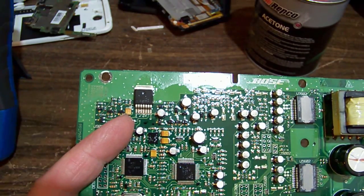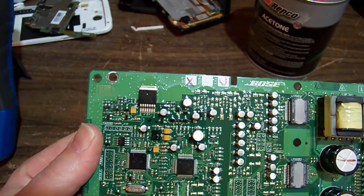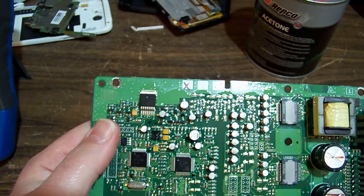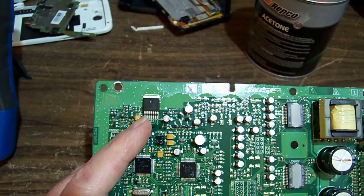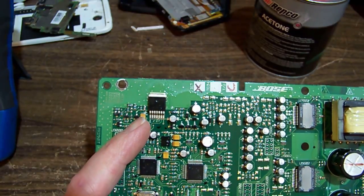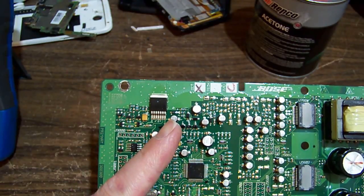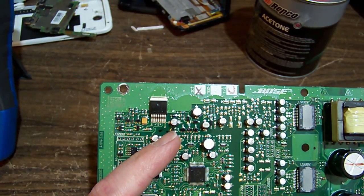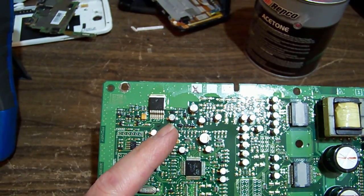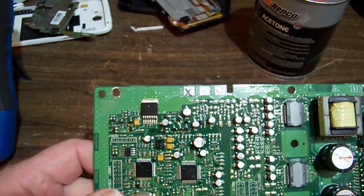So first thing, is it working? So you take a voltage measurement with your 12 volts applied on the other pins, and make sure you've got your V in. So you measure pin 1, and yep, that was 12 volts. And you want to know if it's making power, so check your V out, pin 7. And of course, it wasn't regulating. It was a 5 volt regulator, I believe. So we had nothing coming out the other end.